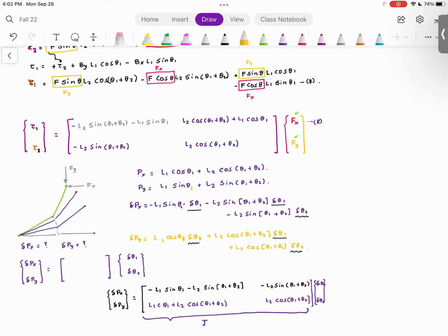It means, remember the forward kinematics analysis that we did, and at the end we found the Jacobian. As soon as you got the Jacobian, you can use that Jacobian to find out the joint torques that are needed to support the static forces. So that's just that one Jacobian. Remember the Jacobian that we derived in last class using MATLAB? That Jacobian would allow you to find out the joint torques that you need for the robot to go from point A to point B.